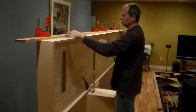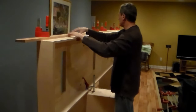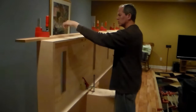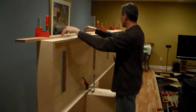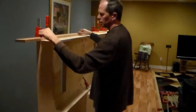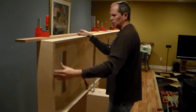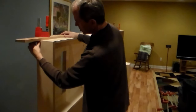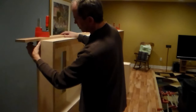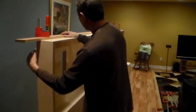And I've decided against doing a second row of dowels. I want to give this wood a chance to move. So dowels on the bottom is all on these, and then when I get these pieces in here and cut, I will double dowel those because those are going in the same species, and there's not as much here for this to hold. There's no skirt or a rib out here, so I want to give this something so it doesn't get kicked in.